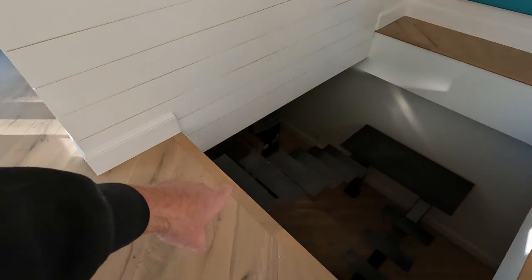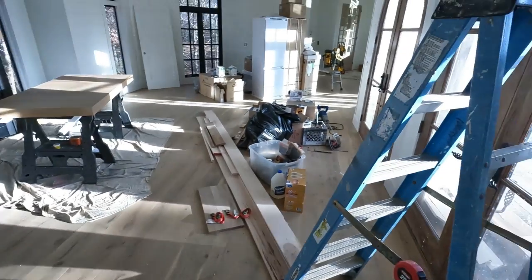Well, we have holes that are pre-drilled into our metal plates. So Steve is outside. I did use some structural screws. I wanted the washer head structural screws, and all I could find were 2 7/8. So he's actually cutting them down to 2.5 inches. That way, my treads are 3 inches, so I didn't want to be that close to the surface. So we're cutting them down roughly 3/8 of an inch so we don't have any issue with the screw trying to protrude and come out the top of the tread.